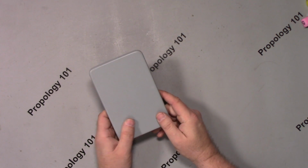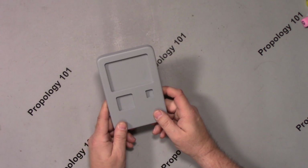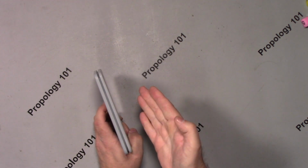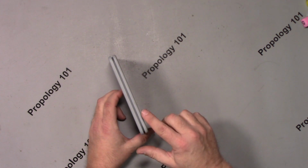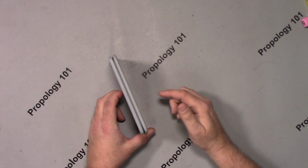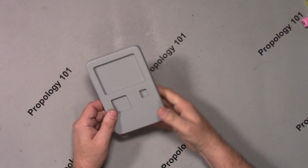The first season versions of the pads were mostly made out of masonite, layered together, machined out on the top layer, and pieced together. This is made the same way, except this is acrylic, 2 layers of 1/4 inch and a layer in the center, which is slightly smaller all the way around, making what they call a reveal. The piece of smaller acrylic is glued in and it's all glued down.